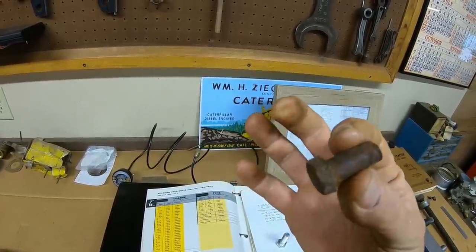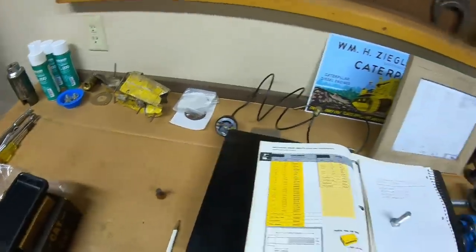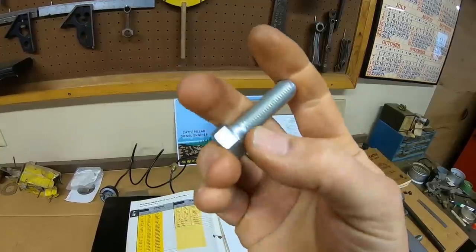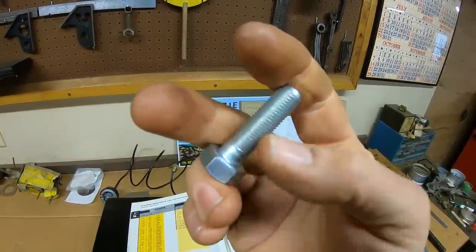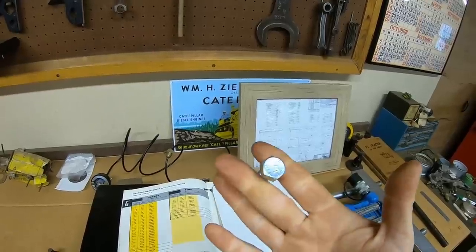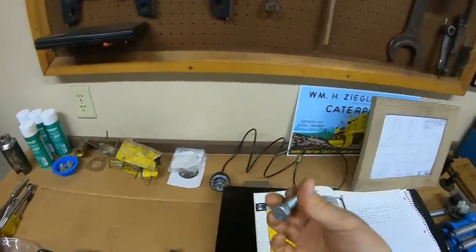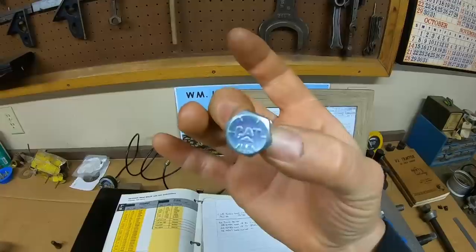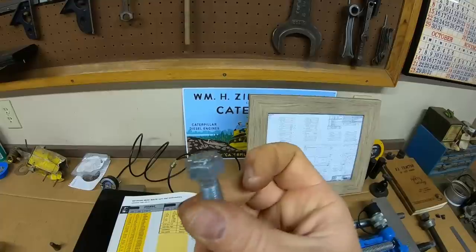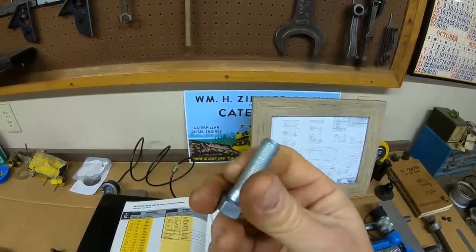This is a much stronger bolt because that unthreaded grip length is going to help it stay tight in the link and pad for much longer. With the new ones, you're contacting most of those bolt holes just with sharp thread tips — they will wear faster. That being said, I will still use these new CAT ones. The other difference is the original bolts had a 5/8 hex head; the new ones are 11/16, much more common. Grade 8 markings on the head, and the classic CAT taller head on the bolt — that's good for undercarriage applications, as you can wear away more material before it starts to fail.